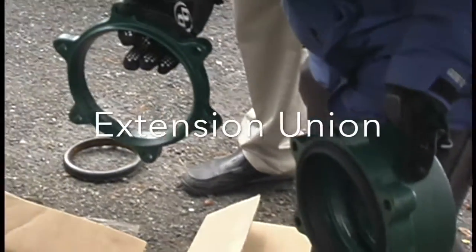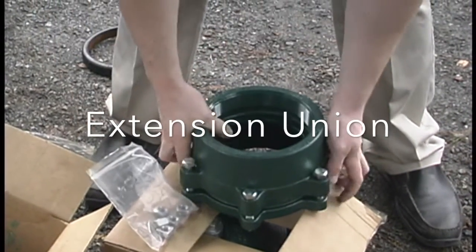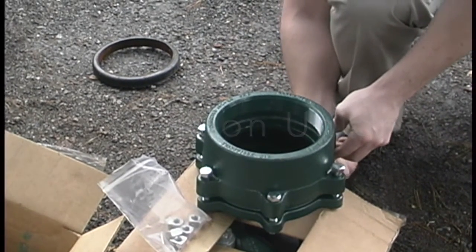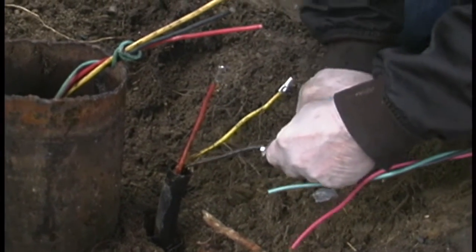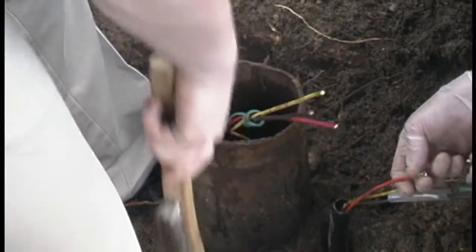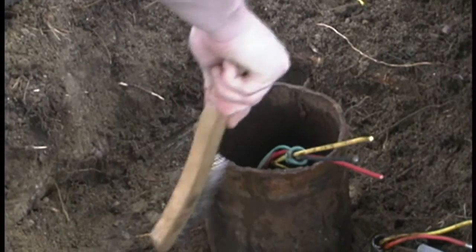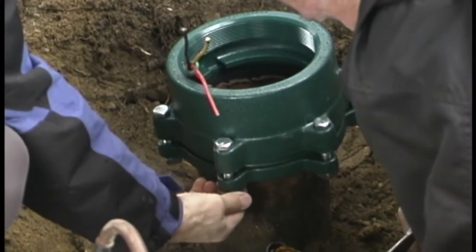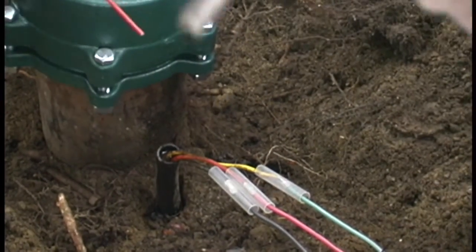Now this is the extension union — this is where we're going to be putting on the existing casing, and this will allow us to screw on an extension casing on top of it. We'll first pre-assemble it by putting on the bolts. We go back and add some wire because we're running a little short — we wouldn't be able to make the extension going around. You want to prep the old casing to clear any burrs that might be there and hindering it from going on. There is a big compression gasket in there and it's going to be fairly clean for that gasket to slide over.